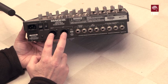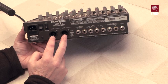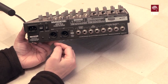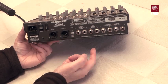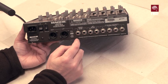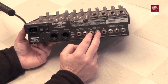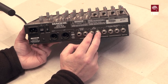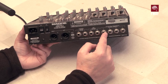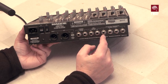These outputs are the principal outputs of the system — a copy of what's on the top — but these are true balanced differential outputs. You can switch the level between +4 VU, which is standard high-level line level for putting into PA systems, or mic level if you're sending to a direct inject device into another mixer. There are also control room outputs, the alternative 3-4 output pair, and channel inserts on each of the four principal mono channels, so you can break in and out — you could even go out to a tape recorder and back for four-channel audio recording.